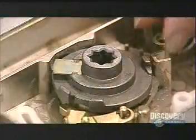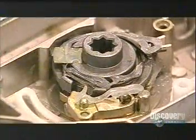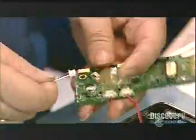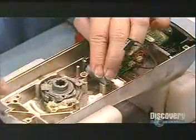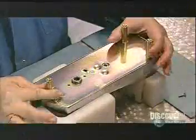After applying more lubricant, they install an override that enables the hotel to open the door with a key if, for some reason, the electronics malfunction. They then install the circuit board and connect it to the various parts it controls, such as the clutch motor, which they install next. Finally, they close up the completed housing with a steel backplate, which protects the components inside from rusting.